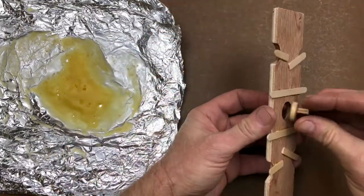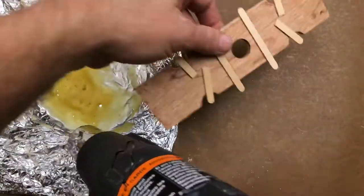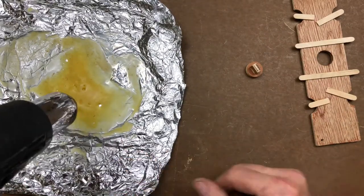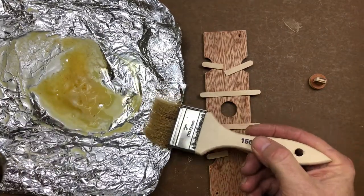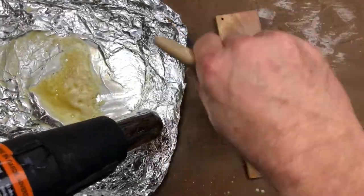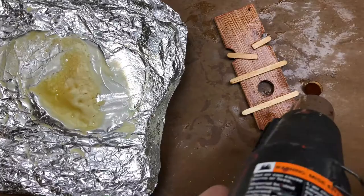These parts are all ready to wax. The little bung goes right in there — just fits in there perfect. Beeswax is nature's all-purpose mold release, absolutely indispensable in my shop. If I only need to wax up a small part like this, I just melt a little bit. We get the bristles of the brush hot, but not hot enough to burn the bristles — just hot enough to melt the wax. Make sure you really wax the sides of the hole because that's where rubber can really stick. Push wax in there good. This is pretty well waxed, just the way we need it, and so is the little bung.